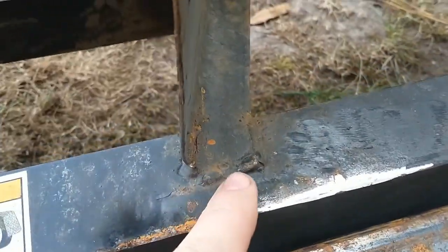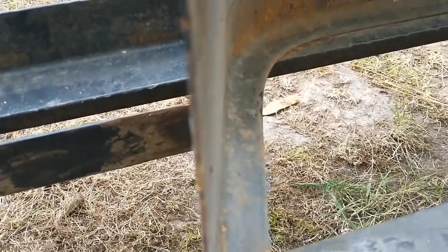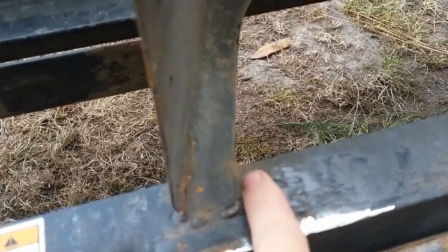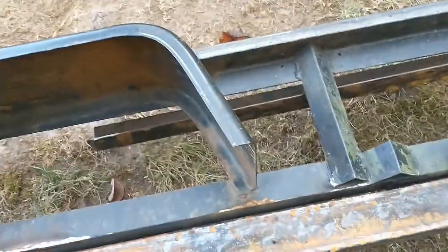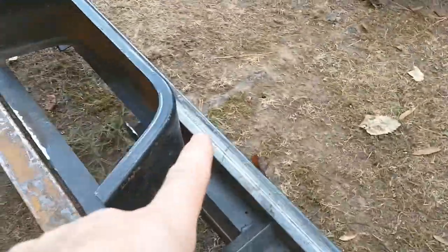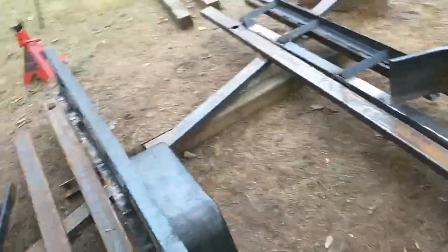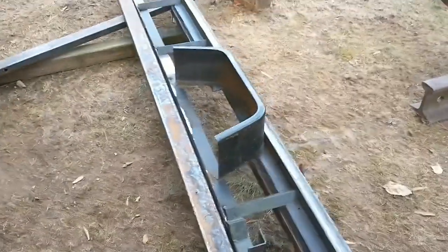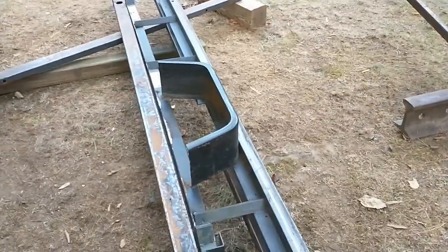Hold on, there you go. He welded this to where I can't even see where the edge is. And he welded that there too. He welded that right there. And this, so I can't tell where the edge of the fender is. I gotta cut all that free. And I think that's a job for the 4-inch grinder on one of these fenders. I think I can actually get up in there with the die grinder and the 2-inch discs and cut it off. But I think I gotta take his fenders off in order to fix this, because they're hampering what I'm doing right now.